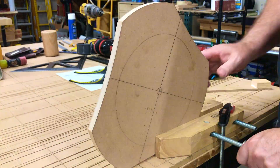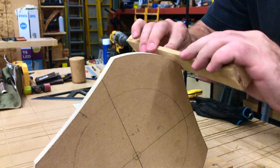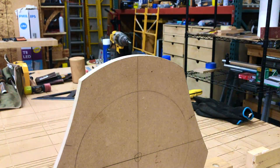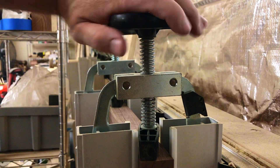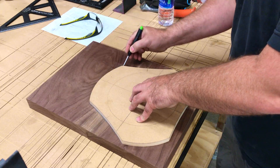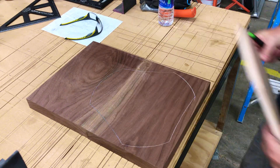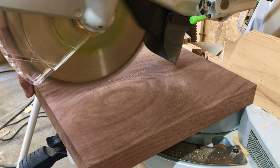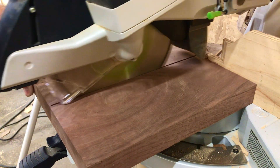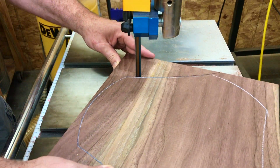Just a little hand work and your template is ready to go. Time to unclamp the piece and trace the template. I'm using a white wax pencil because it shows up much clearer on walnut — that's a great tip right there, you're welcome. Cutting to rough size with the miter saw: I take several passes and cut through the back of the piece before the front to minimize pinching the blade, then it's back to the band saw.